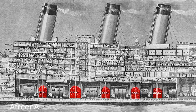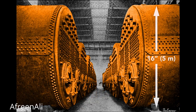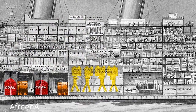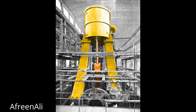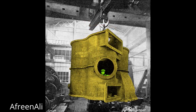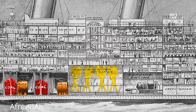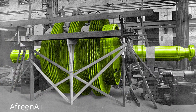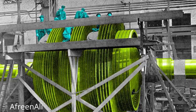As the Titanic crossed the Atlantic, 650 tons of coal per day was shoveled into cylindrical boilers where it was burned to produce steam. These boilers were nearly 16 feet in diameter. This picture shows a single boiler — notice the two workers beside it. The steam was piped to these reciprocating engines. The engines, when viewed from the front of the ship, look like this. The orange is the piston rod, and inside the cylindrical casing is the piston. This worker peering out of this casing gives a sense of the engine's size. Excess steam from these engines was used to drive a turbine engine. This shows the turbine under construction and without its outer casing. Note the workers at the top — this is huge.